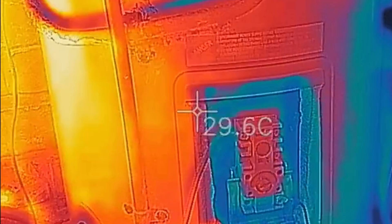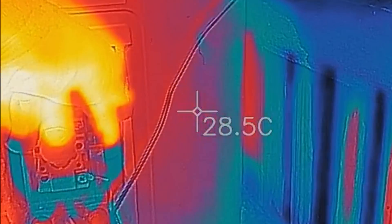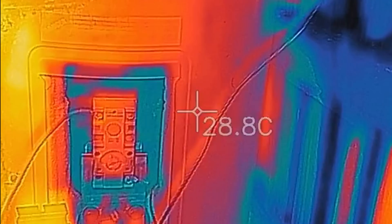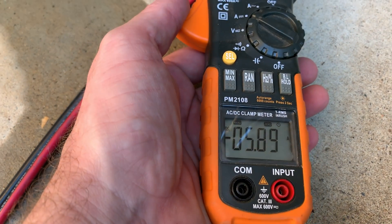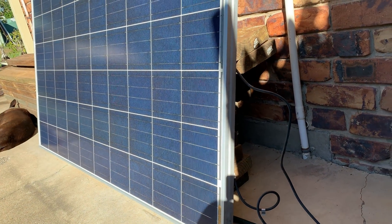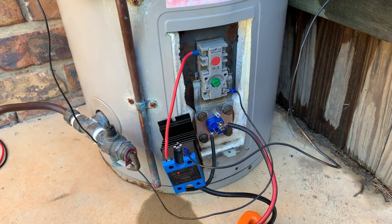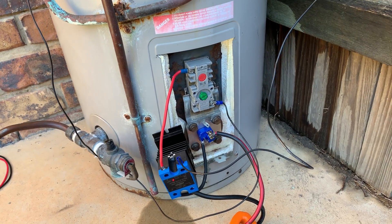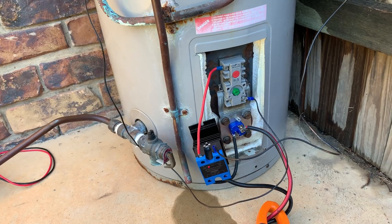Where the light blue rectangle is, with the crosshairs, that's the actual tank itself - I don't know whether that's steel or copper. After two full hours there is no noticeable difference. I can put my hand down here and touch the tank, and that's stone cold - it doesn't even feel like it's heated anything up whatsoever. There's no heat in any cables either. Back to regular video - clearing it off, throwing the clamp meter around there, still doing five amps. I'm not sure why those panels are showing hot cells - it's got to be a fault with the actual panel itself.